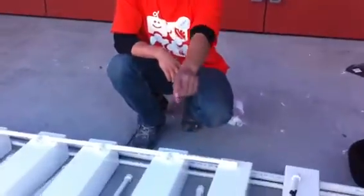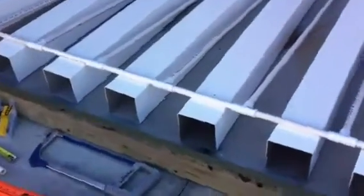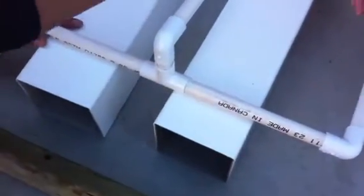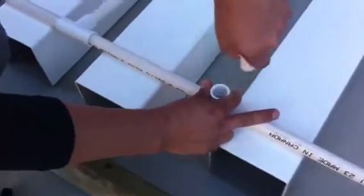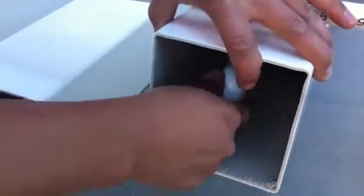So we got the supply line on that side. The way we're thinking about doing this is having this pipe here with the water coming in, going up and into the post. This pipe would be inside the post and we would have to drill from the bottom to get this piece in. We get to this conclusion because we want to fit this piece inside the post — it would be cemented already when we put it in — and then we go through the opening we create here and cement it to the T out here.